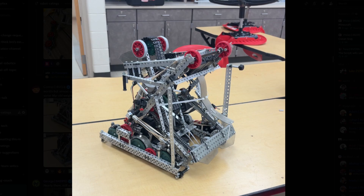One thing is these traction wheels get dirty really quickly. If I were anybody using traction wheels, I would advise wiping them. Don't use alcohol wipes because that makes the wheels less grippy — use baby wipes to get rid of the dust and buildup on the wheels. Your robot is gonna be moving so much faster. Just some tech we figured out.